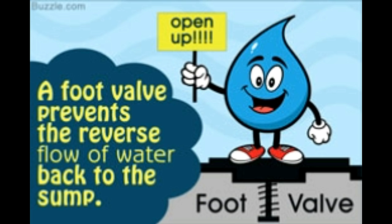How does a foot valve work? A foot valve is what is known as a check valve. Check valves are one-way valves, that is, they can open in only one direction. As such, they allow only a uni-directional flow, and close off when the direction of flow gets reversed. The following diagram shows a typical application of a foot valve in the pumping out of water from a shallow underground water well. Let's study it to understand the working of foot valves.